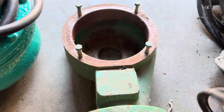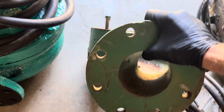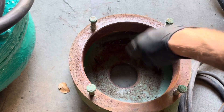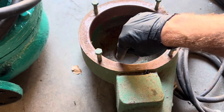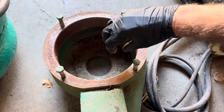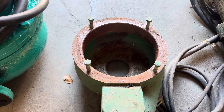What's a volute? This is a really good thing to show you because you need to know it — you're going to be asked about a volute. It's the spiral-looking part of a centrifugal pump's body. You're going to find volutes on centrifugal pumps. What happens is it pulls the water using centrifugal force into the intake and it builds up speed. It's flinging the water, and as it builds up that speed, something called Bernoulli's principle takes effect. Imagine this is all full — when you've got a lot of speed in a full area and then that water slows down because now we're going to a wider area, that velocity slows down and what happens is the pressure goes higher.